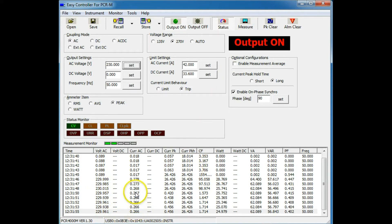Here's the voltage: 230. The current settled down to about a quarter of an amp. You can see there the inrush: 26 and a half amps. Now there's other information there — crest factor, watts, VA, VAR, power factor — all various things that are very useful for analysis. We can save those to a spreadsheet if we like and analyze them later.